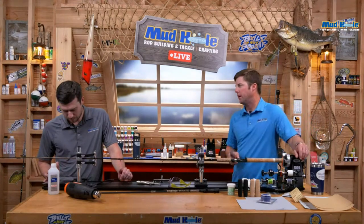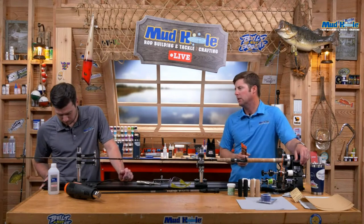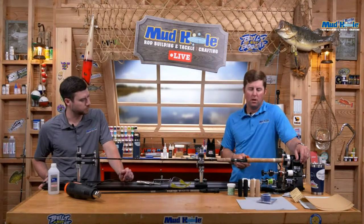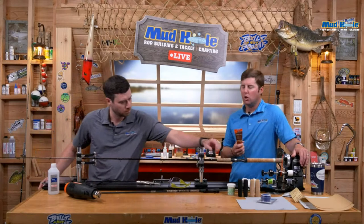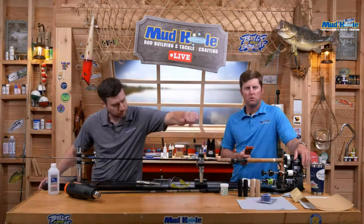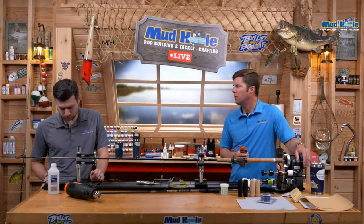I have seen people do that in the past. If they're doing a lot of sanding, you can kind of hoard your cork dust. And if you've got a few pieces in there, and you're doing a big chunk out of there, you can use wood filler and bring back in some of your cork dust. It's been good. I just don't feel like any of the voids I've dealt with have been big enough in the cork to need that much extra work. I just like to hold the shop vac up to it and sand it and let the cork dust go where it needs to go and not have to collect it.